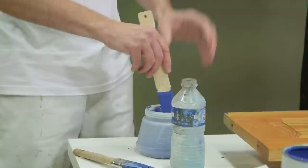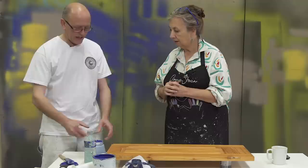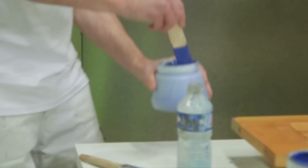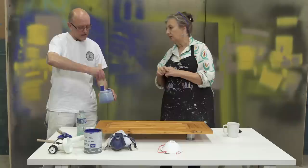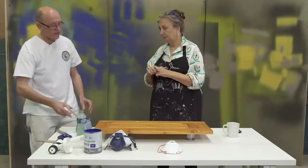We want to make sure it's all stirred in. If you've got layers of thin paint and thick paint, what the gun will do is spray the thick paint, and then all of a sudden it'll hit some thin paint and the finish will alter. So you've really got to mix well. There we go — that's disappearing almost completely. It's still got a little bit, but it's a very small amount so if we go with that I think we'll be fine.